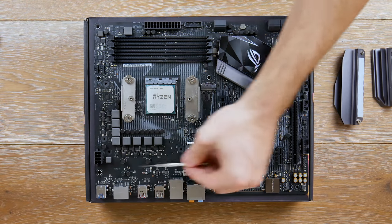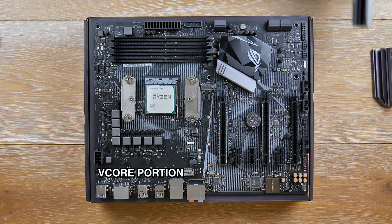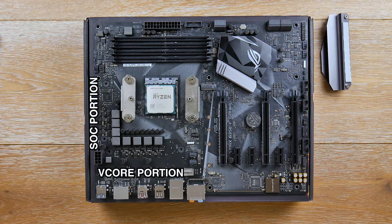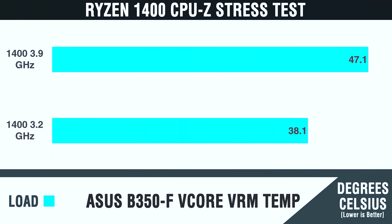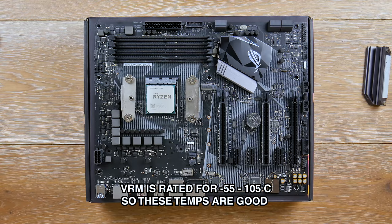This is the rear IO right here. This is part of the VRM design — there are two heatsinks. This main heatsink covers the VRM that controls all power going to the processor. At 3.2 GHz on the Ryzen 1400 under load using CPU-Z, we saw temps of about 38.1°C, and at 3.9 GHz it was about 47.1°C — not too bad, adequate for the VRM design.